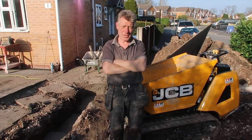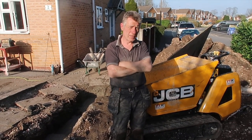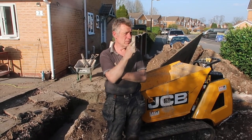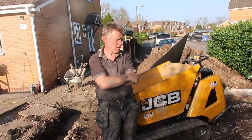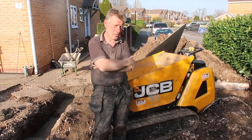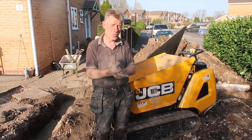This should really be the end of the second day but it's the third day because we had the digger breakdown. We've dug out the foundations, levelled them up, got the concrete in, and as an extra we've put in thick gauge mesh to give it a bit of extra strength because of the tree roots. That tree is coming down on the 30th so it will be gone and we've cut the roots out. Our third day - we're ready now to build up and get the oversite on. It's been a good day, we've made use of the beautiful weather. We'll catch you next time when we put in up to the damp course, oversite, and then the garage going up. Thanks for watching, catch you later.